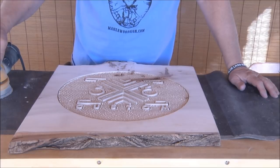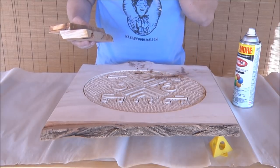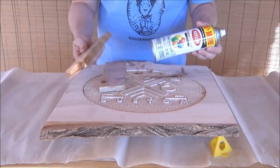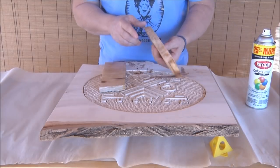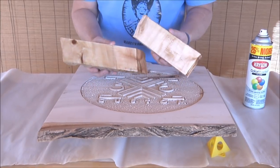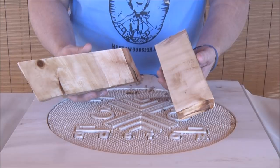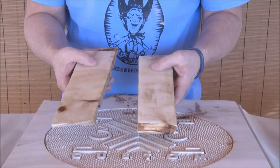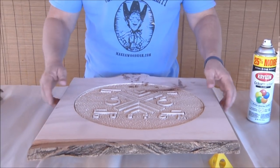Alright folks, here's what we're going to do now. Every time I've done a resin pour I really haven't spent any time sealing it up. So I experimented with a couple pieces of scrap white poplar and sprayed it with my Krylon Crystal Clear — one was satin and the other was gloss. I put about three coats on and then did a really fast resin pour on those. I got no chemical reaction, so it appears I can use that as a sealer underneath the resin.